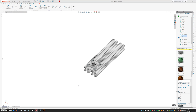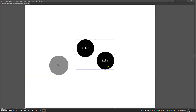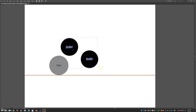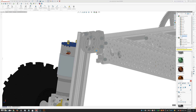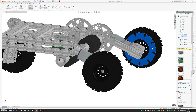That opens up a lot of possibilities for compatibility with face through-hole and face-tapped components from the Actobotics library. The legs with wheels give this project its crazy stance. In a setup like this, the exact angle of attack that those rollers end up having and the overall deck height of the robot would mean the difference between successfully grabbing a can or just driving over it. So I wanted that to be really adjustable in the field, using one-inch bore clamping mounts on each of these legs.